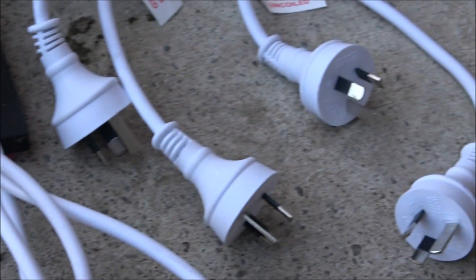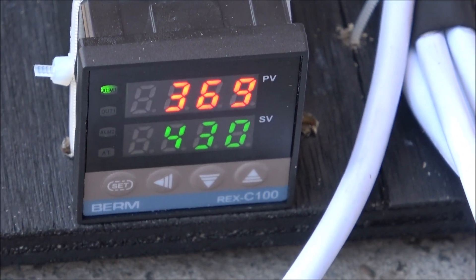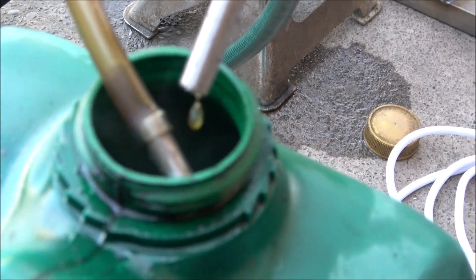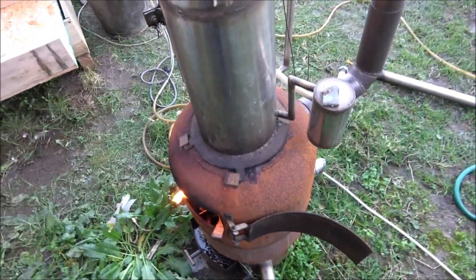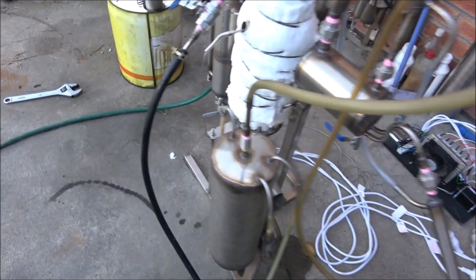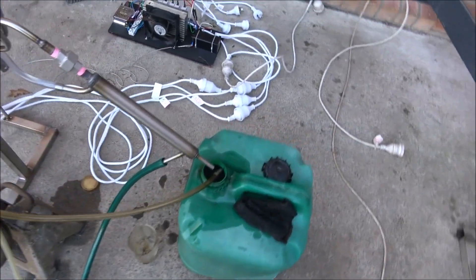Now I've finished the distillation and removed all the lids. The controller is still running and showing the actual temperature — 369°C within the reactor with some remains of oil inside. It's still dribbling a little bit and some gases are still being produced, burning off. I'm waiting for the still to cool down completely, then I'll disassemble it. Later I'll check the light fraction in the cylinder — the amount we got from this particular batch.